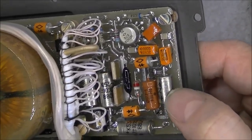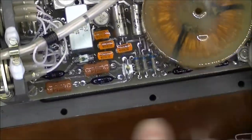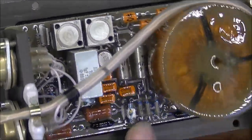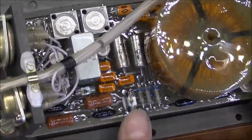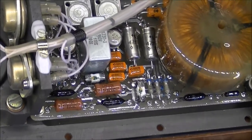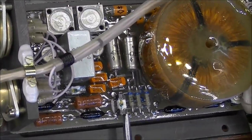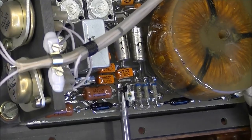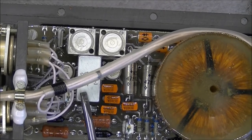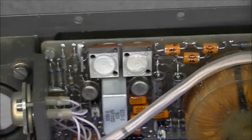Glass body, germanium diodes here. Little diodes here and little standoffs. You can see them better at this level. I believe they are just diodes, but they are very small, like a little drop, and with two very thin legs. And they did actually place some piece of plastic under them and glue everything together, as you can see with this white epoxy glue or something. This can here, I was thinking about a relay, but no. It is just a big capacitor in a can.